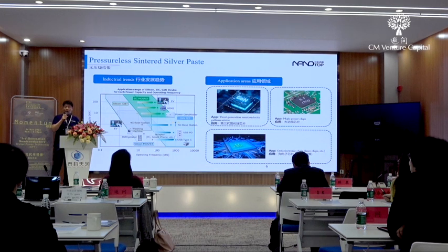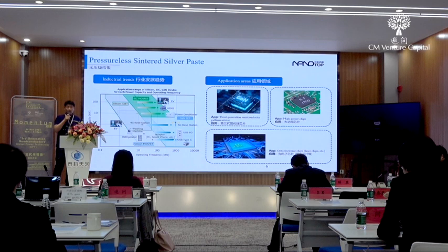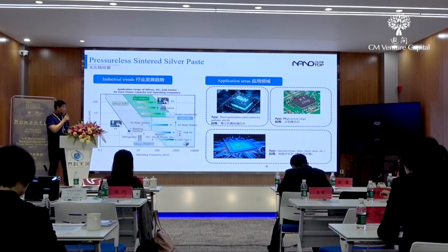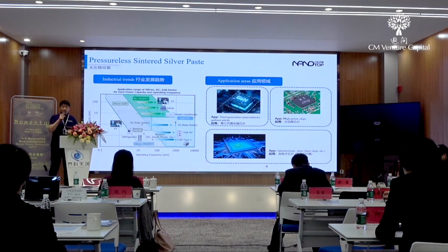All right, and please allow me to thank Derek, who talked a lot about the applications of packaging materials in the third generation of the industry. For me, I'd like to quickly go over the applications. One thing I'd like to mention is that when we use the superior performance of the third generation silicon carbide and gallium nitride, the problem is that when operating at steady high voltage or high temperature, they produce a large amount of heat. So heat management during the design process becomes a real concern.